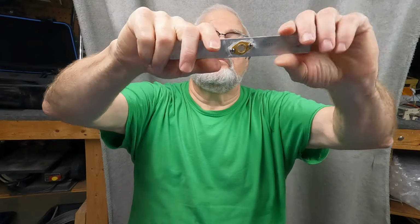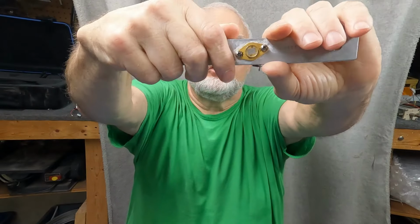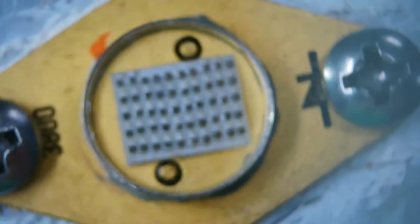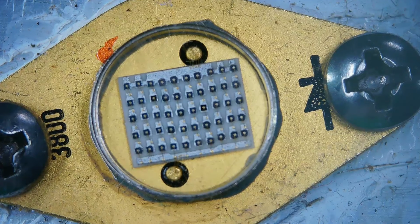And then here's an LED I bought a long time ago. This thing is 880 nanometers. And you look at it and it's a grid array, right? So let's see what the grid array really looks like. We'll bring this microscope back up real high. Okay, we'll focus it in. And you can see that there's a grid array of diodes in there. So what is it? 5 by 10. So 50 individual LED elements, right?